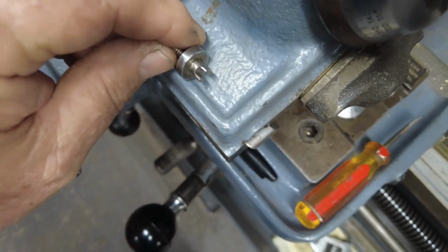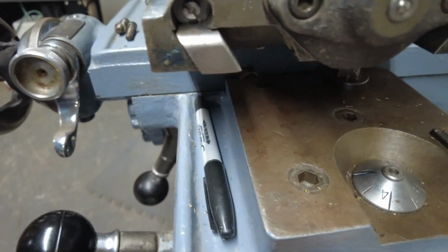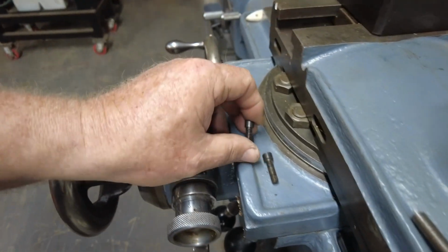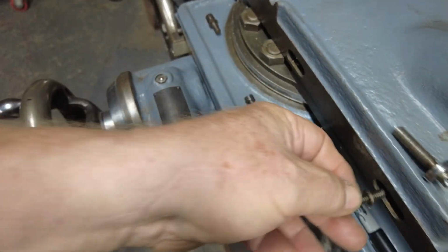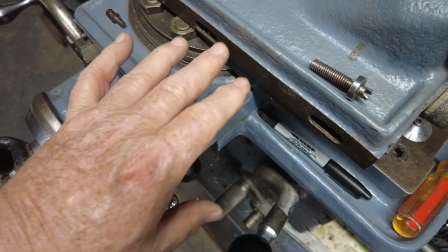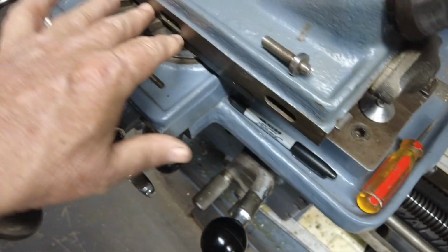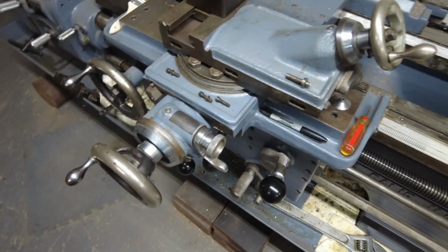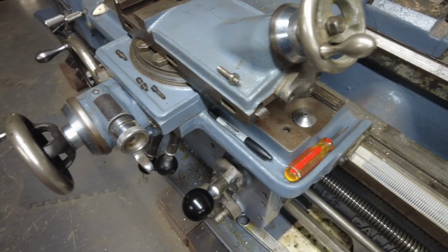The reason that happened is because the people started messing with that little screw in there, you'll see it in there, without loosening these side screws. And this is what holds it in place. There's 3 of them. This just adjusts it, and then this locks it in place. Well, they started cranking on it and bent that all to pieces because they didn't know to unscrew it. So always unlock the locking screws before you screw around.